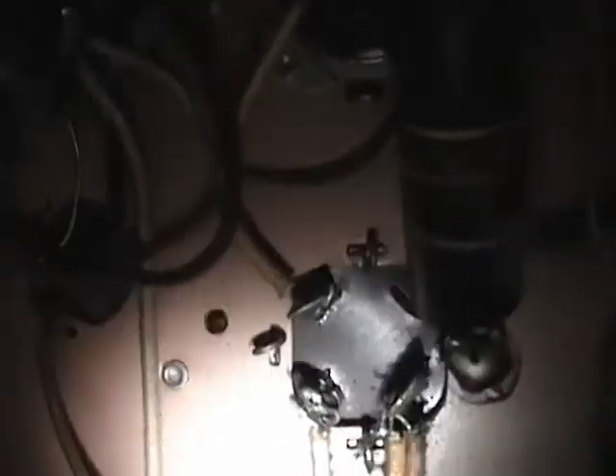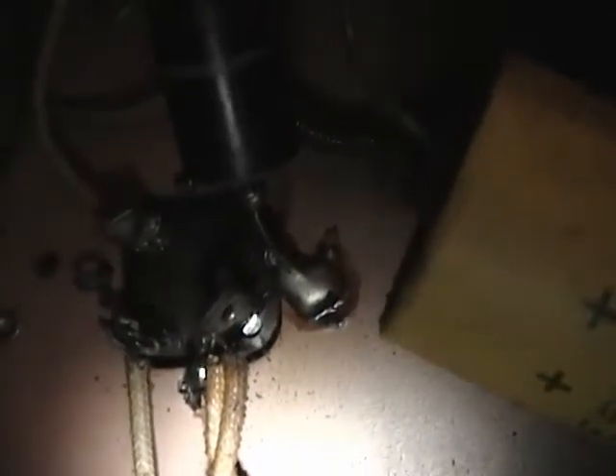Here's that same capacitor, and they're not labeled really dramatically, but if you look on the outside there's a little bit of a half moon there, and on this one it's a little square, and this guy has a triangle in there — hiding a little bit, but trust me it's there. Plus, since there are only three sections, the fourth terminal is going to be the last one — the common.